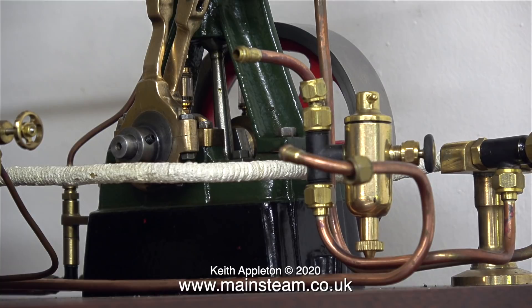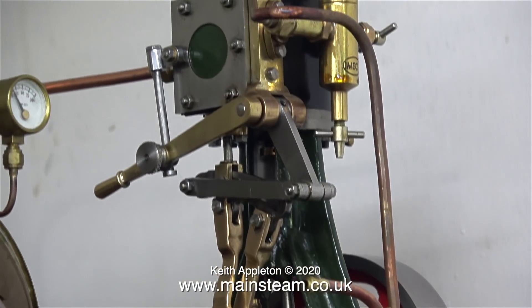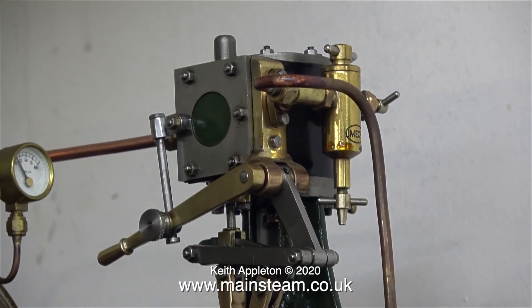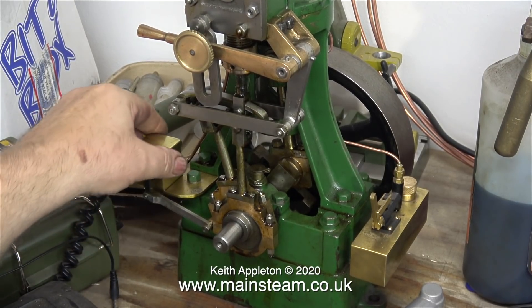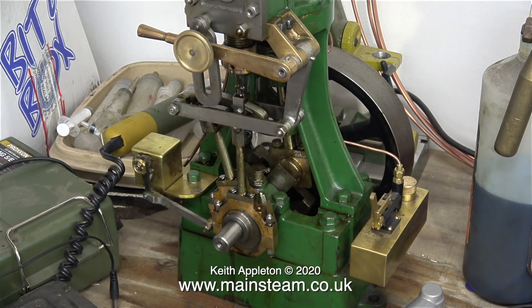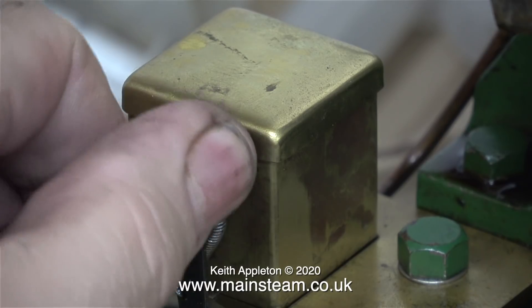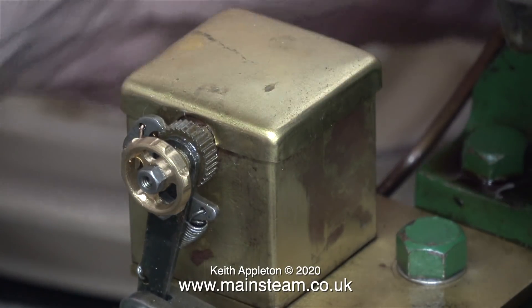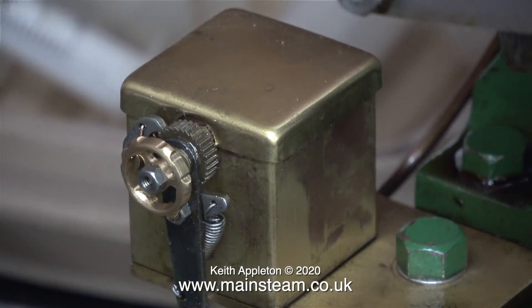This is an image from an ongoing project. I fitted a smaller lubricator to the water pump, which is not connected at the moment, and there's another type of lubricator fitted to the engine steam chest — this is very well made and a little bit more delicate than the Stuart type. You can use displacement lubricators on much bigger engines. This for instance is a Stuart 5A — a large and powerful engine — and I fitted a mechanical lubricator to it. This is a ratchet type mechanical lubricator where, as the arm goes back and forth, a small oscillating cylinder-type pump inside the tank pumps the oil into the steam chest, lubricating everything in there including the cylinder.